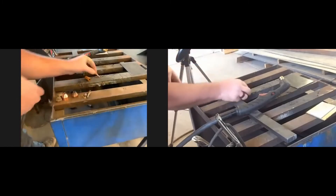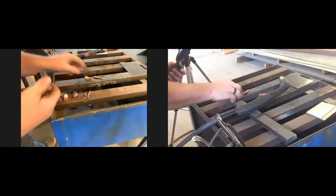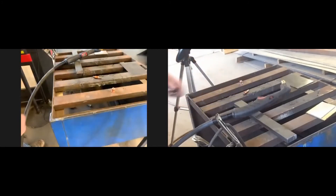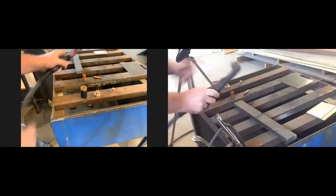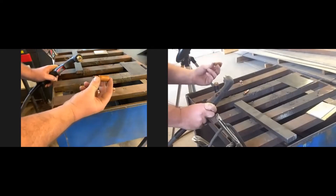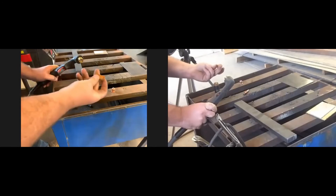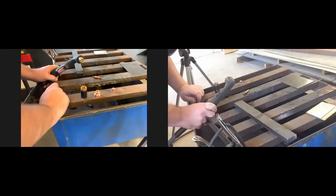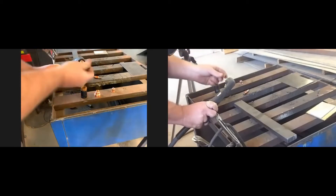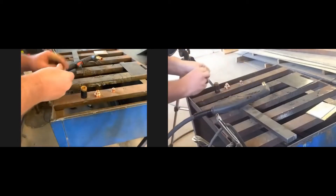On the gun there are some internal pieces. There are really four parts that make up that tip. The first is this small plastic piece called the swirl ring — we typically don't have to replace this. The swirl ring takes the gas flowing through the plasma and creates a swirling tornado-like effect, ensuring a nice clean cut. It only needs replacement if things overheat.